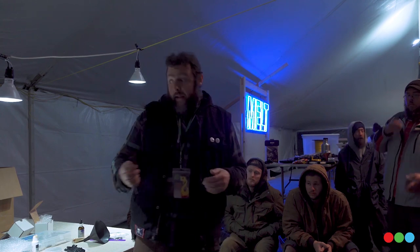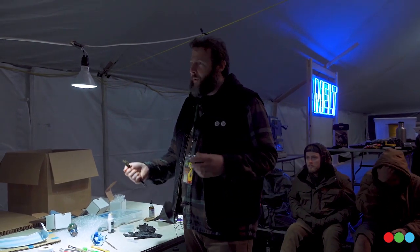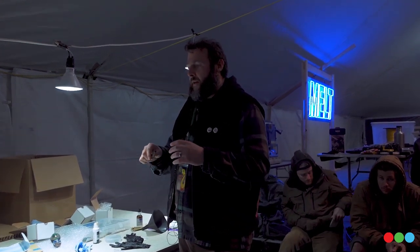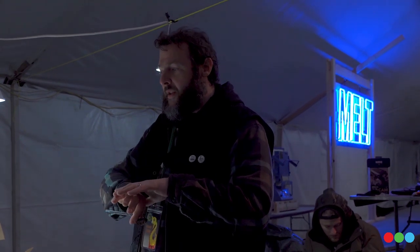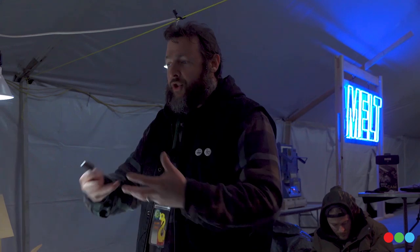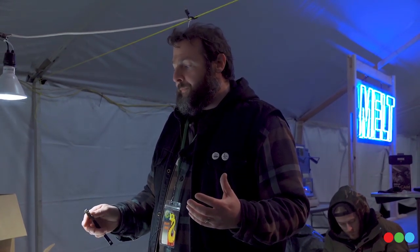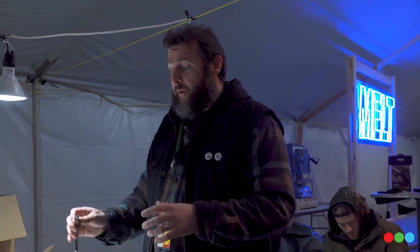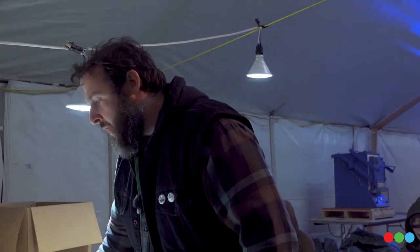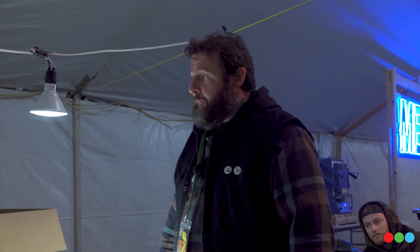And I try to not wire brush it any more than I have to, and I try to not use force, but I try to create a very consistent surface. If you think of it as the patina is going to soak in a little bit, I try to make sure that it's consistent with itself. So I just wire brush the whole thing. I do that on every single marble. Then I will patina it.